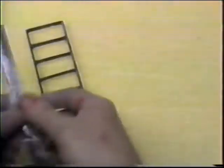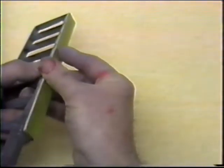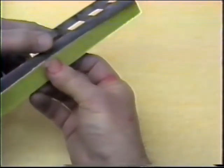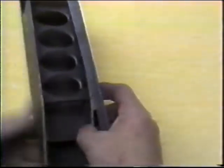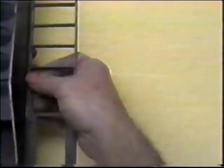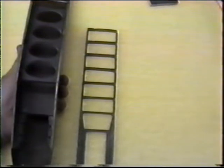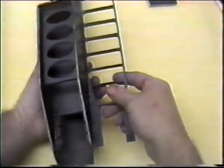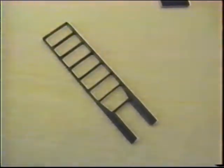I finally resolved to my own satisfaction what I had done wrong: I had allowed for the doublers to be mounted to the side of the crutch, and then inadvertently when I mounted them, I wound up mounting them the other way. So what happened is I lost the thickness of the two doublers. But it's given me a chance — and I'm not as depressed as I was this morning. By looking at this now, I can take into account all the material that has to be removed from the crutch — in fact, I can get rid of that whole last bar, get rid of the angles. Having a part already made up to use as a template is going to be a big advantage in trying to get this done. My mother always used to say it builds character to live through these disappointments.